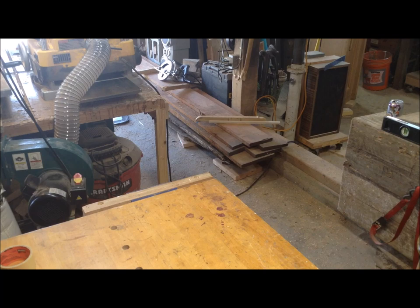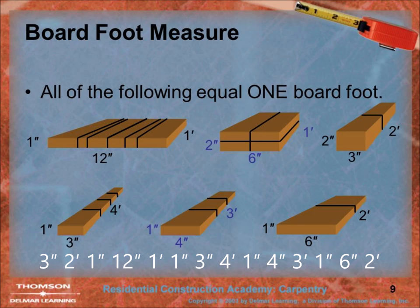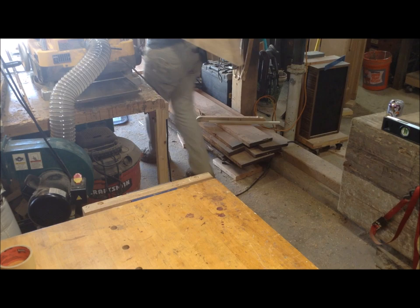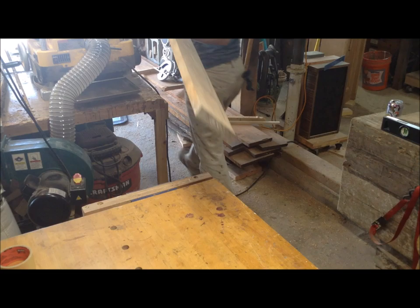When I go to Greg's, I have a board foot already calculated for my projects. A board foot is any configuration of a foot by a foot by an inch, but that measurement changes based on width, thickness, and length of your boards. All of these pieces of lumber shown in the graphic is one board foot. I use a website — I'll put links in the description — which helps you calculate all your board feet. You also should add 15 to 20% to that number, because you're going to be losing a lot of material.